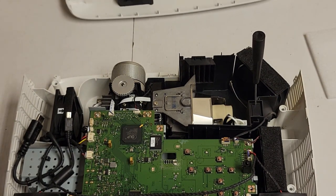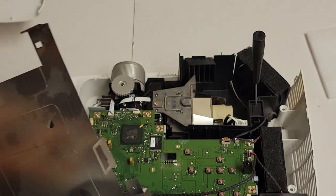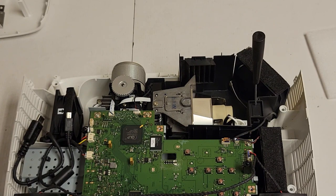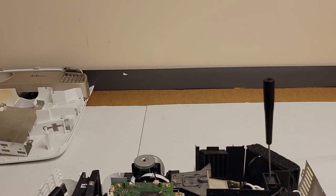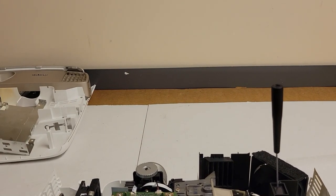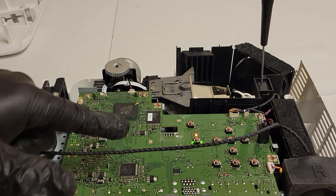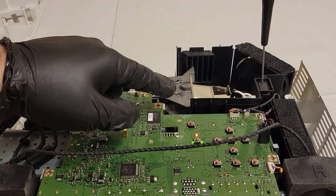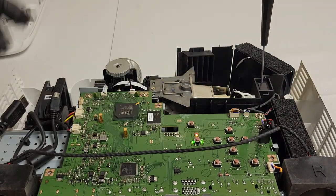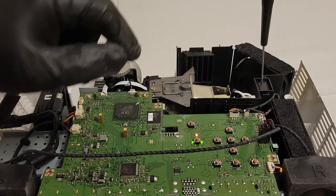I'm gonna move some of the top pieces out of the way so that we can just do a little bit of a test by shining it on the wall. So let me, I'm gonna move the camera a little and bring you guys right back. All right, let's get some power. All right, standby light. That's good. So when I hit the power, we should hear the color wheel spin up, lamp should strike, fans should come on at their pace. We should hopefully hear a little boop boop from the speakers, that's the word I'm looking for. And then we should have a picture on the screen.